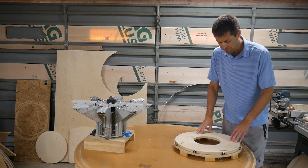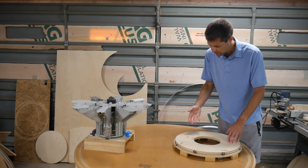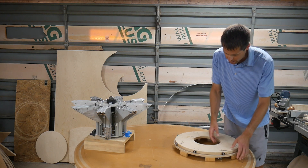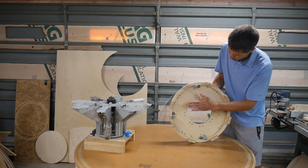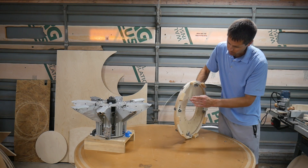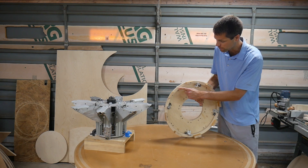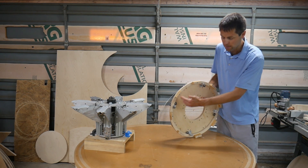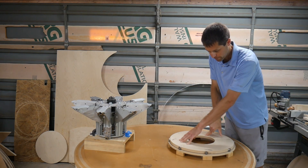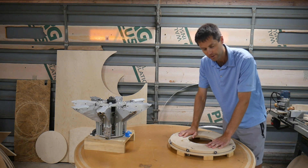For a larger table this could easily become larger, and it's low profile which gives you more options on the legs underneath the table. The construction is pretty simple — we have the one piece here, bearings around the outside, bearings here to control it horizontally, and then bearings here to resist the uplift force. All of these are referenced off of one piece of wood which has factory surfaces on two sides, and the other one can be done with a router and a circle jig, so they're all quite smooth, giving you quite a smooth motion while also being fairly tight in all of the axes.